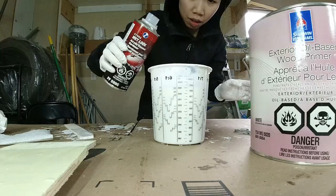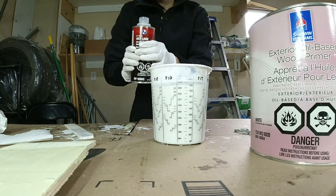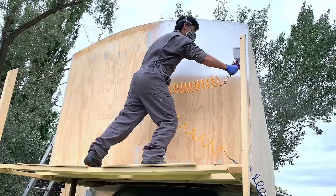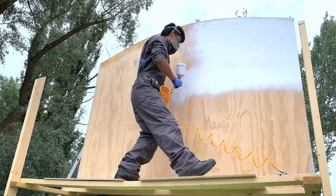They have an oil-based wood primer product that is specifically designed for wood, obviously. And we did some actual testing on some little boards of wood, testing different combinations of what would work. What we found is that the thinned metal paint, as we would be spraying it, just soaked into the wood fibers. So it would take, in my opinion, a minimum of 2 or 3 coats to make it look acceptable, and we did not have that amount of paint.